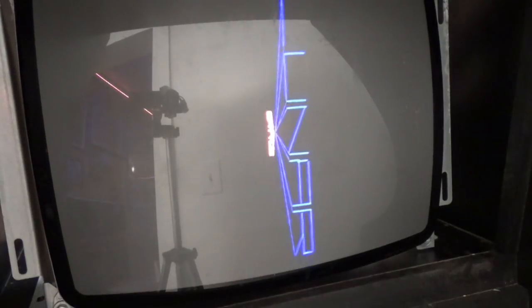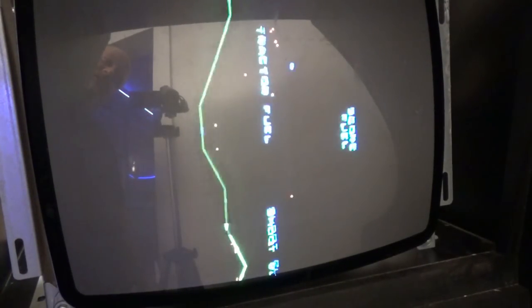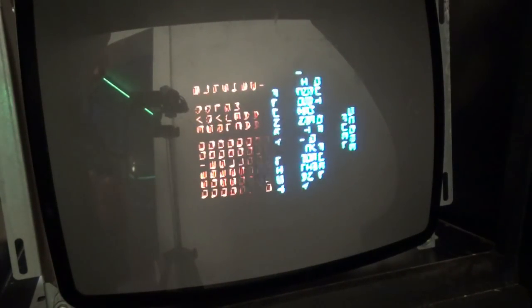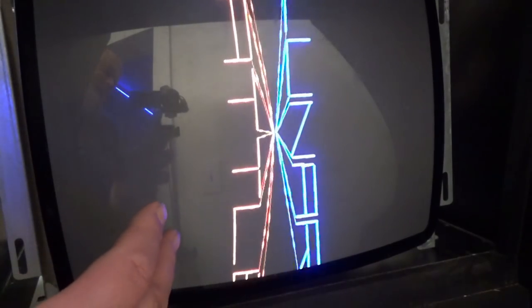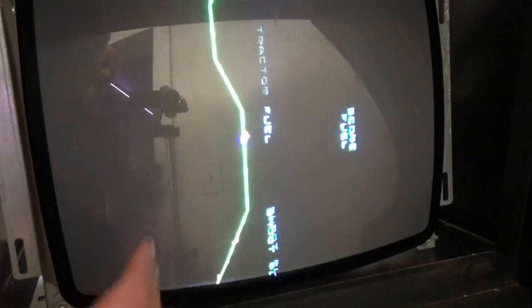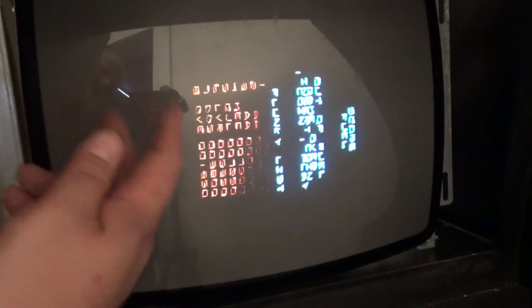I think I have the wiring right now, so let me go over to the other game and put this on. Hopefully we won't see any smoke. Looks like it's working — convergence is clearly off and it's sideways. So that's good. At this point I could choose to rotate the yoke, but I want to keep this back in its original convergence if possible. So I'm going to swap X and Y around, because I put the yoke back the exact way it was, and I'd like to keep the convergence rings exactly how they were.